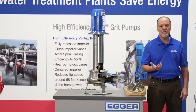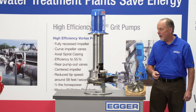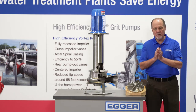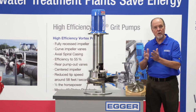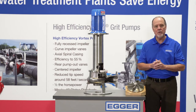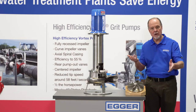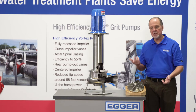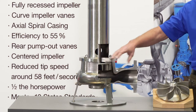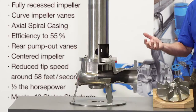In fact, this pump is nearly 50% efficiency. What makes this pump special is there's no mechanical seal in the process and no bearing. Your number one failure in a grit pump is the mechanical seal and the bearings — one results in the other. So if we could provide a pump that has no bearing and seal in the process, we've just extended longevity.